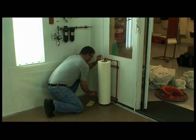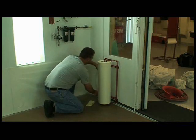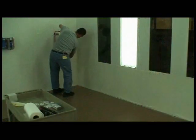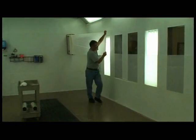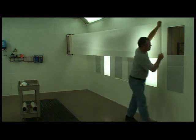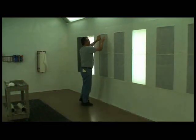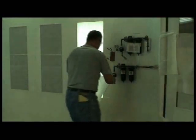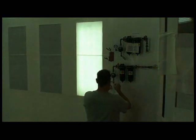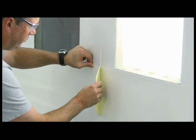Make any final alignment adjustments and squeegee material one last time. Keep in mind a few wrinkles are inevitable, but will not affect performance. Move the dispenser up and repeat the process for the second and third sections of the wall, overlapping each new section by one half to one inch. Typically, it only takes three sections to provide adequate wall protection. Next, use a safety cutter to cut around all windows and lights. Material cutouts may be used to protect other booth areas, including end doors, around booth obstacles and covering paint scales. Be sure to squeegee any loose ends around cutout areas.